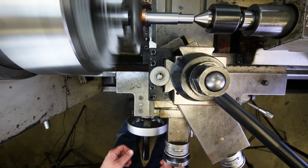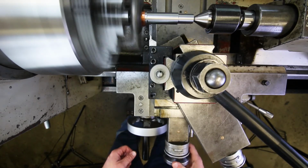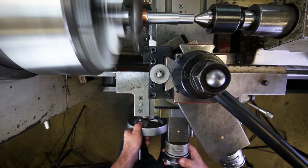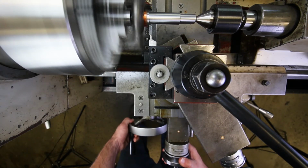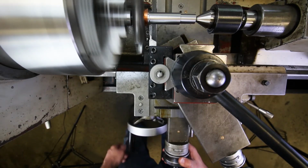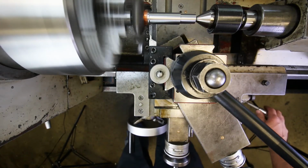So here's what I'm gonna do. I'm gonna position the tool relatively close to the part surface like that, okay? And then I'm going to move to the left with the carriage just until I pull a little bit of a chip on that shoulder, that 3-inch shoulder that we already made. Be careful that you don't touch off too hard because it's going to move the position of the shoulder. Okay, right there. Here it's chattering a little bit. Now let me show you something.